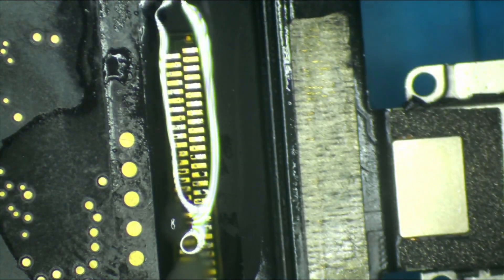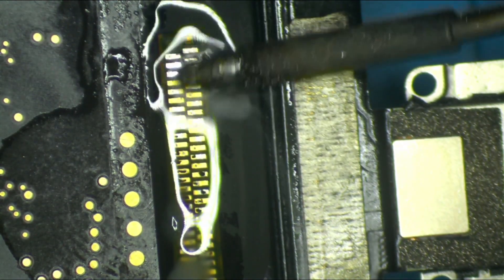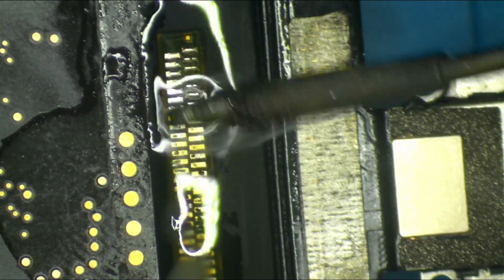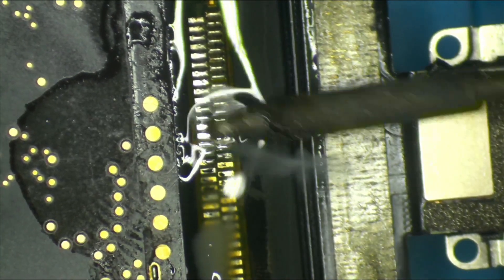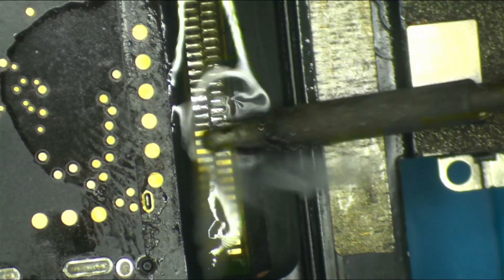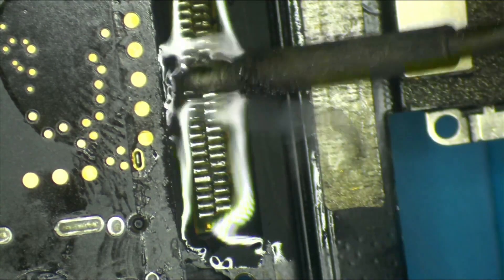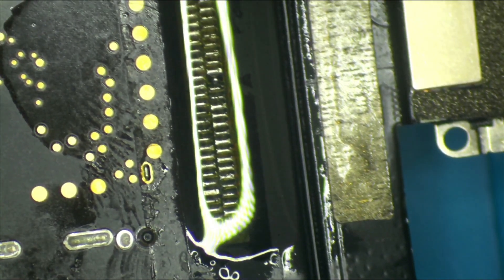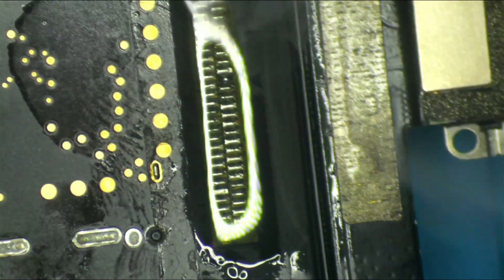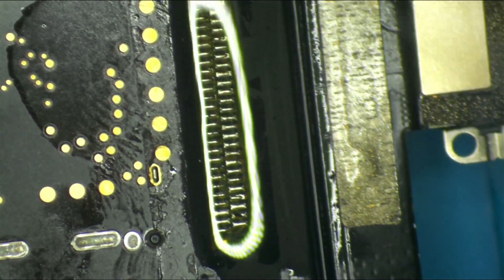All right, I've done that. So when I come in with these docks, the reason I'm adding low melt is — when I then heat up the dock, I'm not fighting with factory solder. I really need my fume extractor out here — I'm sitting here breathing in fumes. Anyway, what I'm doing is adding that low melt to the dock until it looks nice and schmick.